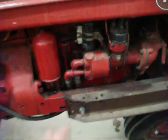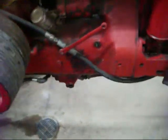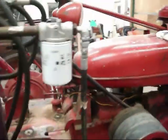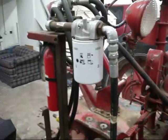It does have a live pump on the distributor here. And like they typically did, they tapped a hole into the old belly pump and run a suction line up to there, and then this comes back and goes up to this, because it had a loader on it when I bought it, and I took that off, and I just made this little holder here for a valve so I could use it for pulling the hay bine around and doing whatever I had to do with hydraulics.